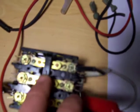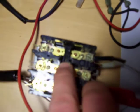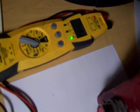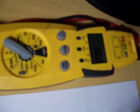My demonstration purpose is I have a 24-volt secondary three-pole contactor which when it closes you can hear my ohms meter, which I have across it, close. We'll have it on all the time — you see it goes on or off — or we'll switch it here and use our push button.